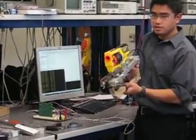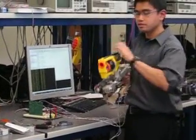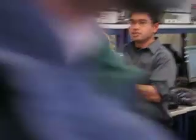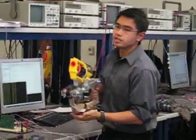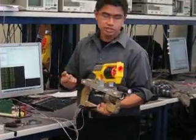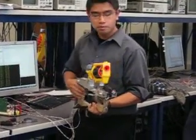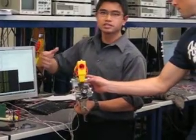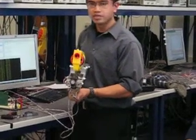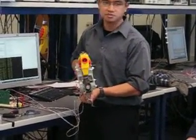It still needs to be calibrated. Another thing that came up that we didn't expect from the sensor is that it's not very accurate. It will give you a nice range with centimeter resolution for five meters or so, but within a room like this it gets a lot of noise, and that's one of the things we have to deal with. Unfortunately, they don't make laser range finders cheap enough for us to use.